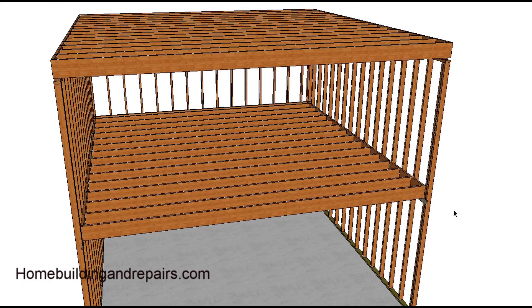Here's what it would look like without the floor or wall to give you a better view — ribbon again supporting the joist, blocks for the perimeter nailing on the plywood. You put your piece of plywood down and you'll be able to nail into the block, which gives you perimeter nailing. Around the edges where the plywood breaks you might need 6 inches on-center nailing around the perimeter, compared to 12 inches on-center in the field on the joist.